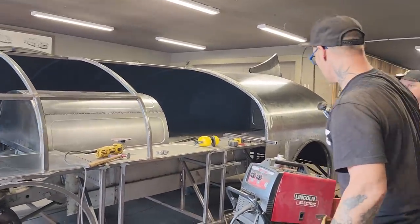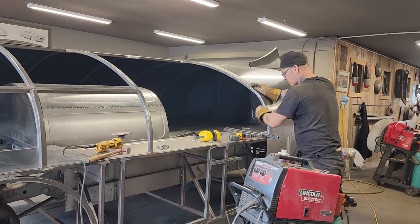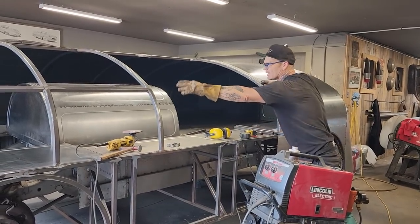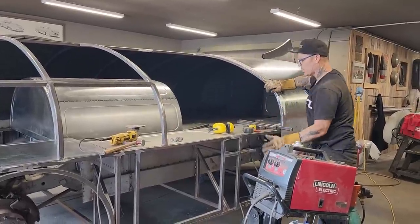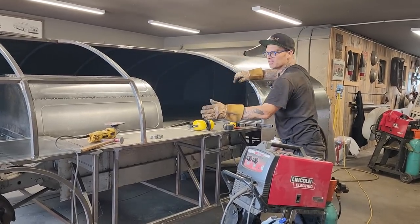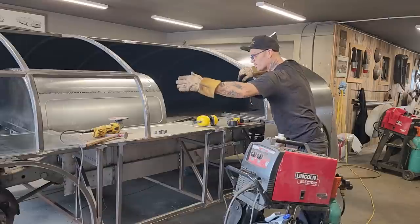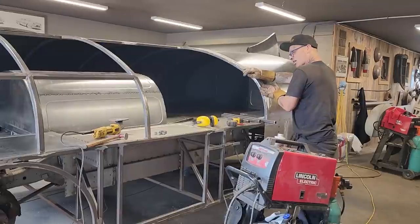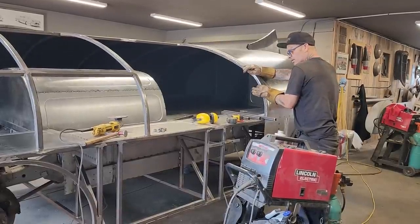Well, if I take some square stock and run along here, some 3/4 inch and smaller stuff, and I squared it up and made the door and tacked it to this piece all the way around and put another rib in the center to make the door, when I covered it with sheet metal, I wouldn't be able to get the door or this piece cut open, if you know what I'm trying to say, because I would not be able to see from the top side where to cut it, because I'm 3/4 inch in.